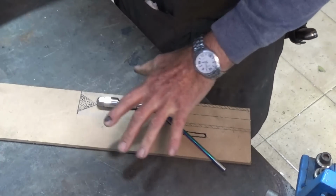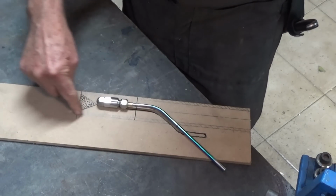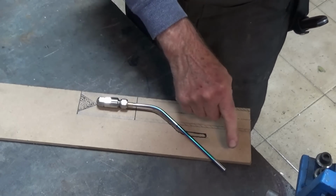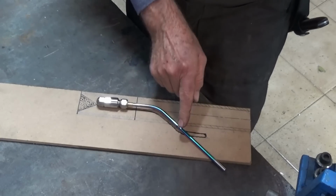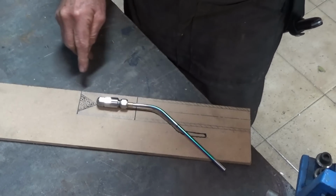And that's what I've drawn here in my 2D mock-up. So here's the front half of the burner that's fitted into the furnace. Here's the back half that's removable. And I've got the fuel assembly fitted there so far. What I need to do is put a bend back here and bring this back section of the fuel delivery tube parallel to the removable section of the burner.